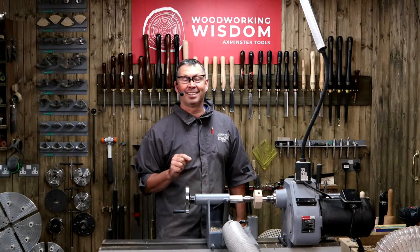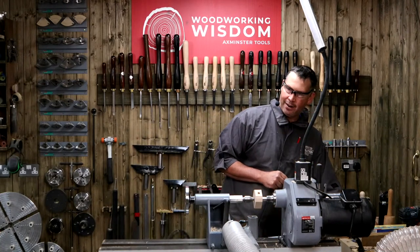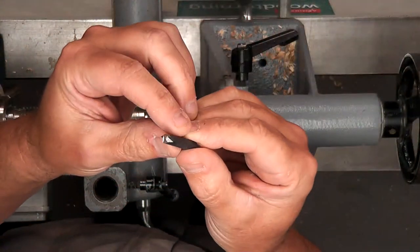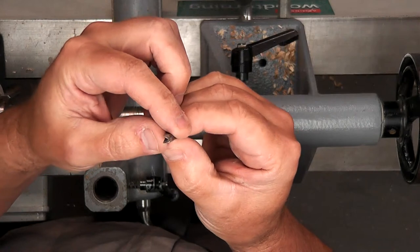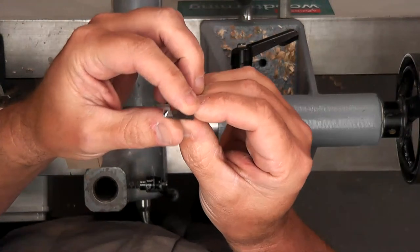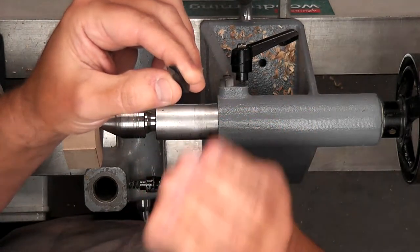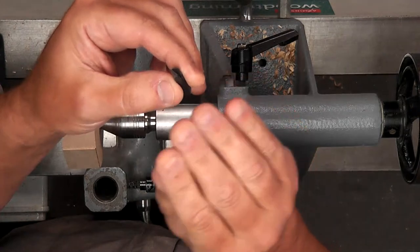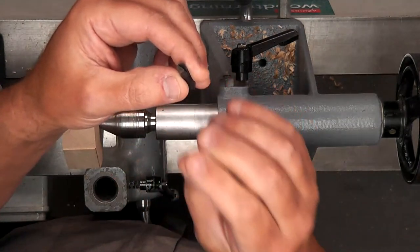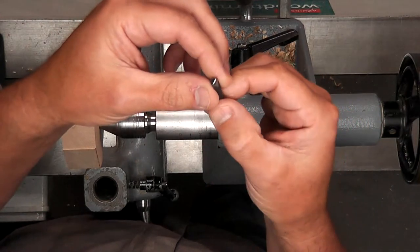You're dead right. It does take a little bit of practice to set it. I do have a blade here. Let me just show the camera. All right, so that's the blade. They are simple V, and they need to be absolute razor sharp. In terms of the angle at the back, I don't know that for sure, but I wouldn't change it from what it comes with, because I found that that works the best. I've tried to change the angle, and it needs a bevel rubbing, basically.